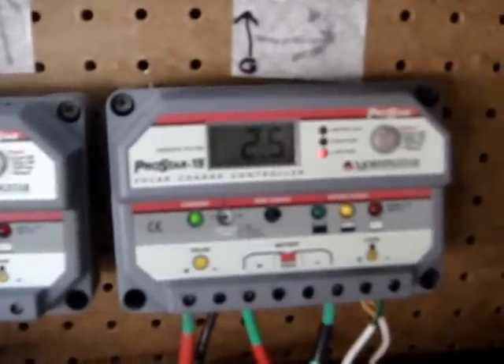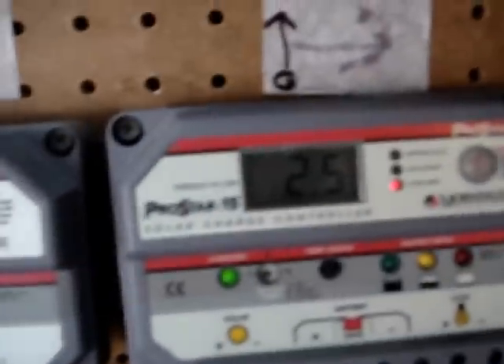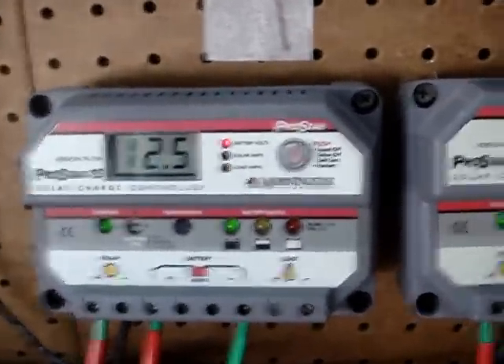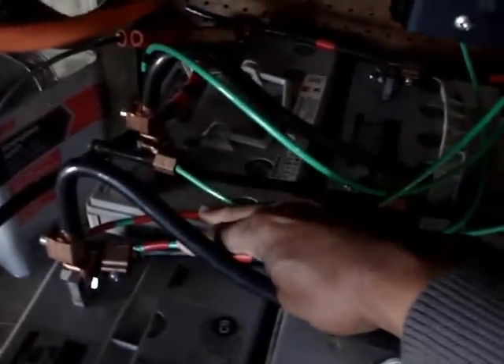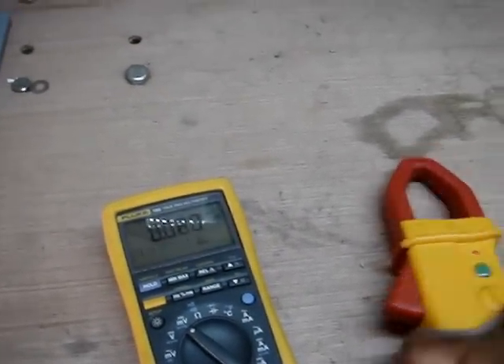You can see the power I'm making from the panels on the charge controller — 19 amps there and 18 amps here. That's 18 amps there and 19 amps coming in on this at 12 volts. That's all these charge controllers can handle. They're actually rated at 15 amps but I have a little more than that coming in. The power coming in is going down here to my battery bank — those green wires, my two positives and two negatives on different ends of my battery bank.